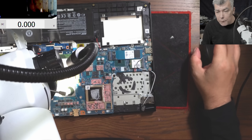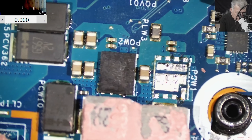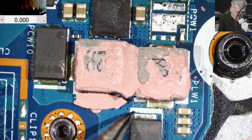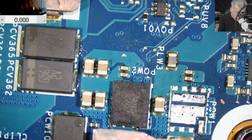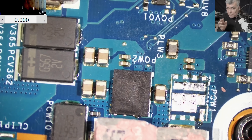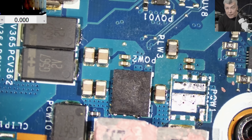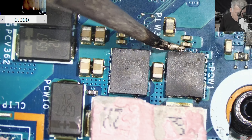Keep in mind when replacing MOSFETs in this case: we have two MOSFETs doing the same job, with both output coils connected together. The MOSFETs must be the same, otherwise one MOSFET will work harder than the other. So when you have a shorted MOSFET, replace both MOSFETs. Let's get the solder out.